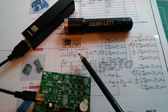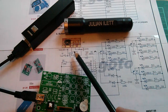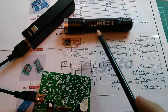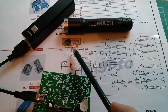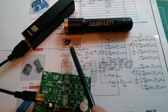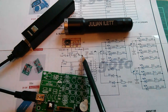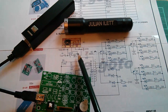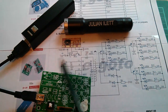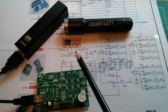When I was putting my finger on the transistor I was going across base to collector — I was probably lifting the base just a little bit, enough that this chip could burst into life. But I don't really think that's the solution. I think the answer is to put in a base resistor. You want to limit the current flowing out of the music chip through the base of the transistor and through the base-emitter junction, which is effectively just a diode down to ground. There's going to be a lot of current flow through there without a base resistor.